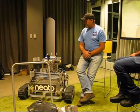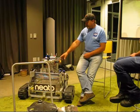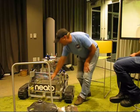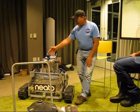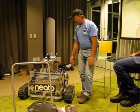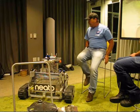So that's a challenge. The second Arduino over there controls all the manipulator functions. There's a total of 5 motors in the manipulator. The 2 arms, the 2 hands, which you haven't seen run. The hands come together, and then the tray motor, the tray moves out. The hands can only drop the samples here in the front. So to drop more samples than the front 3, they go into the back. The tray comes out, you drop the samples in, then the tray goes back in. There's another smart motor that controls the tray going back and forth. And so that's a total of 7 motors, 2 controllers.